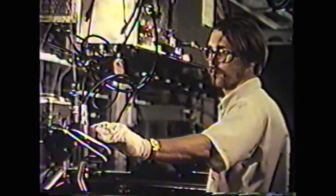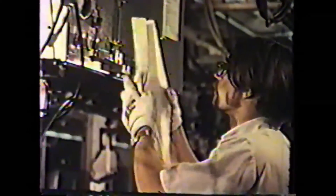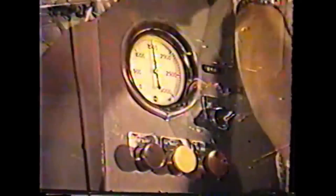Throughout the assembly sequence, the built-in station concept is the bible. For example, brake systems are evacuated, pressure-filled, and tested as the chassis moves down the line. Same thing with air conditioners — if any discrepancies pop up, they are corrected immediately. No waiting until the car passes through final inspection, no waiting for problems to accumulate. If necessary, the line stops. You build cars right for the first time. This is the road to reliability.